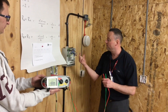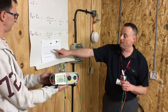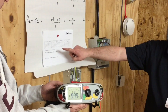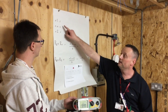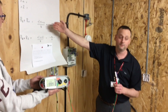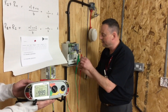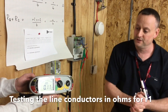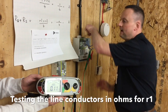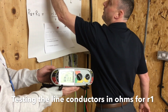First of all, we're going to measure end-to-end: little r1, little rn, and little r2, which are populated in our test paperwork here at college and also in any test paperwork in the real world. We'll record r1, rn, and r2 before going on to the next stage to perform two calculations. We'll first do little r1 end-to-end on the cables with the instrument set up on continuity, and our reading is going to be 0.11 ohms.